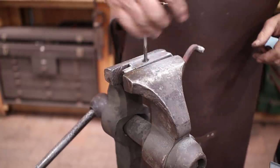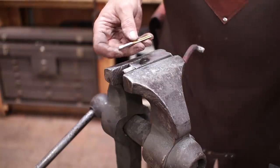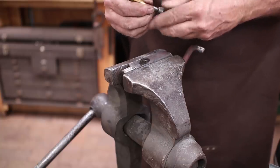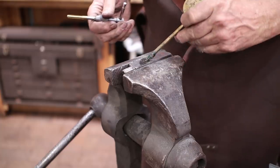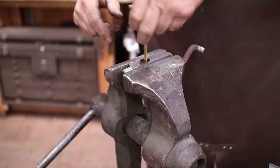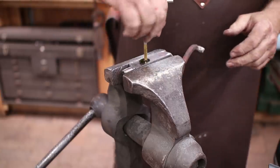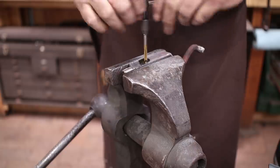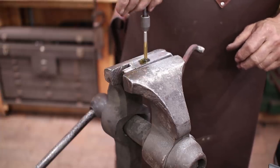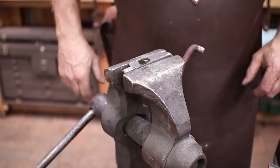This is a tapered tap. I might want to see if I've got a bottoming tap for this so I can cut threads right to the bottom of the hole — and it looks like I have just what I need. This one doesn't come to a point, so you need to start it with the other one ideally. But then this should get me just a couple more threads cut, and that'll be more secure. So that's five — a little bit more than a quarter-inch worth of threads. That ought to work just fine.